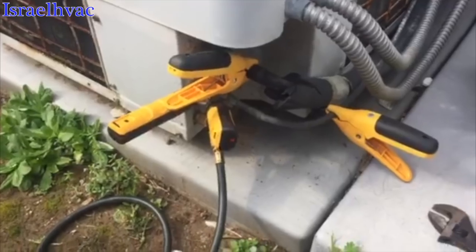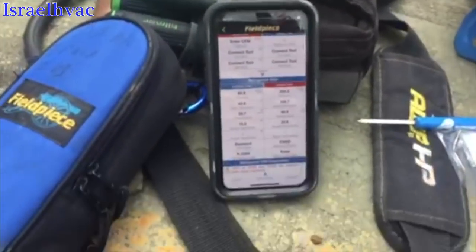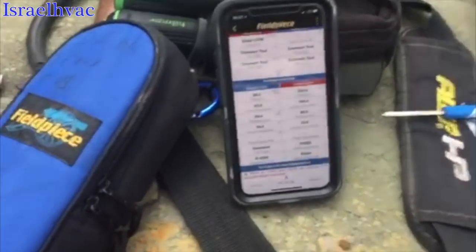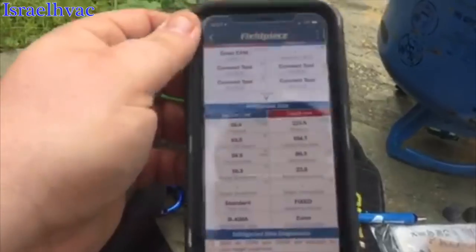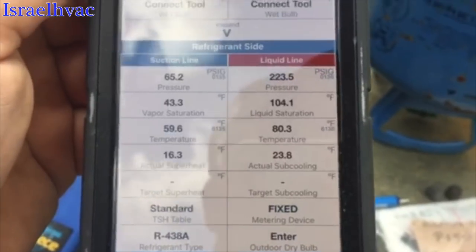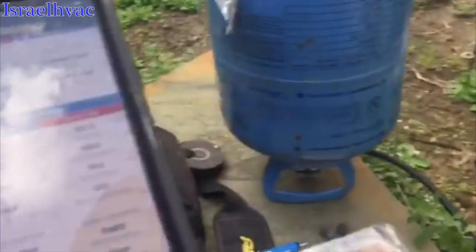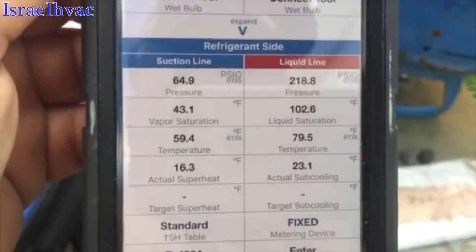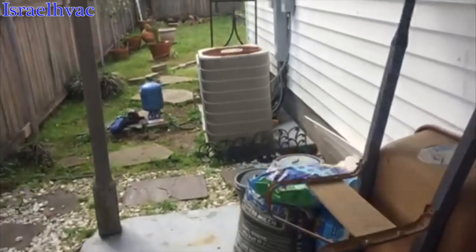There are the FieldPiece probes. I'm glad I was able to get this cleared up so y'all wouldn't think I was over-exaggerating about the range. It's not doing 'connect tool, connect tool' anymore — must have been something wrong with the phone. On my personal phone, the app is working just fine. You've got your target superheat. I don't have my airflow probes in, but if I go put the airflow probes in, it would remotely give me my target superheat — which is pretty cool. There are your pressures, temperatures, superheat, and subcooling.